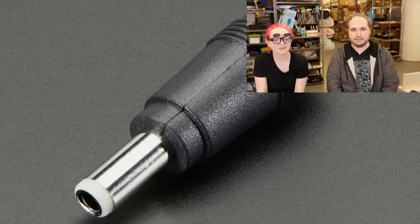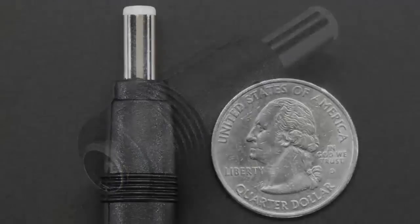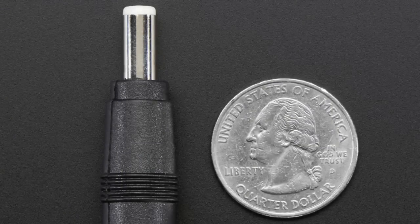This is a little adapter. Once in a while you have devices that have a 5.5/2.5mm DC jack and the inner prong is slightly too large, so you can try to plug in a 2.1mm DC power supply but it just won't fit and you really shouldn't force it. You can use this adapter — it will take the larger plug and convert it to the slightly smaller plug. It's really hard to tell by looking at a device which one it is. All the power adapters we carry are 2.1mm center positive, and this basically just lets you use them with those wacky devices.